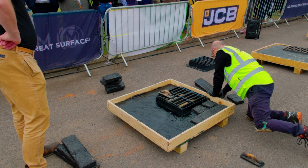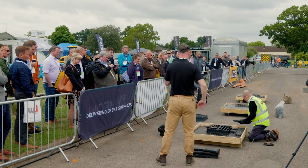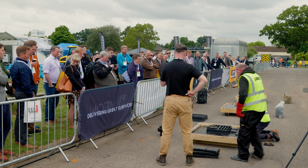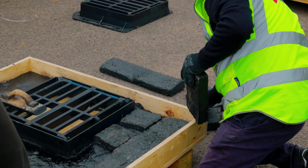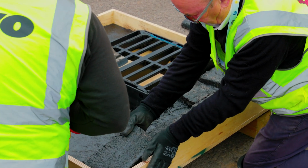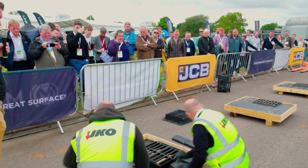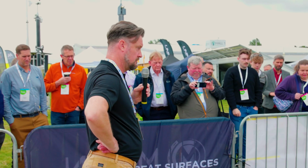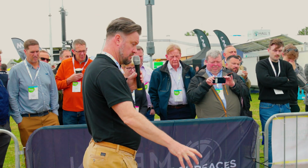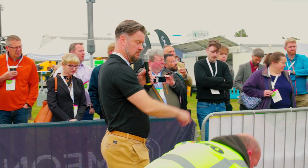So again, the bricks can just be broken as long as you're ensuring that 10 mil space in between, so that when you're grouting, you're making sure that you're getting the hot material between the Paco bricks. And they can be larger spacings. It's not a fixed 10 mil. So then they'll just work their way around, and you'll get the bricks embedded, and basically it will look like the third one down there.